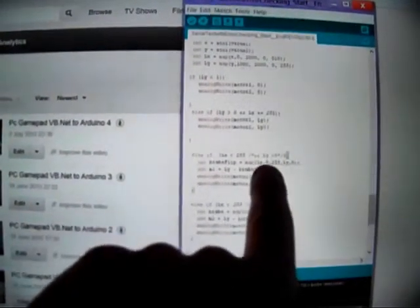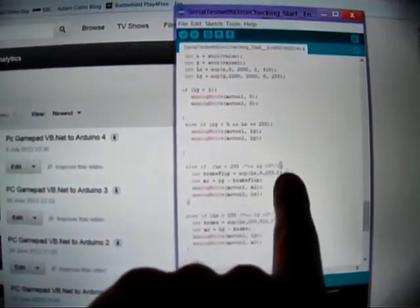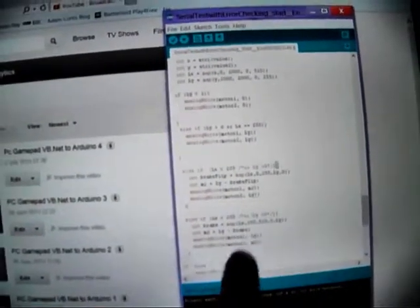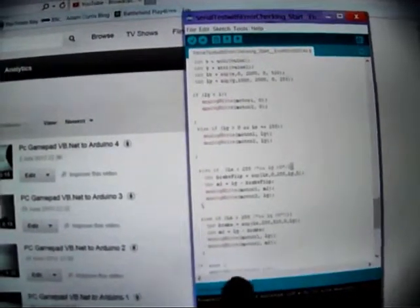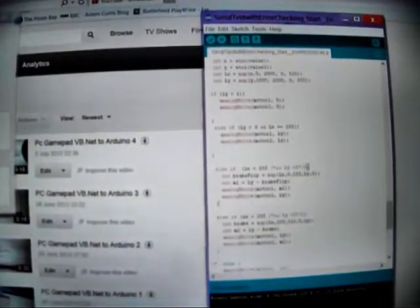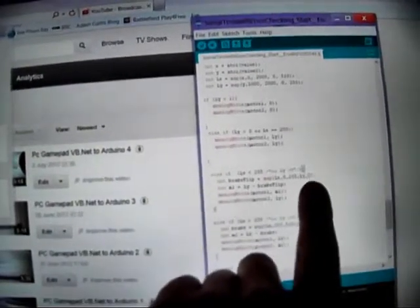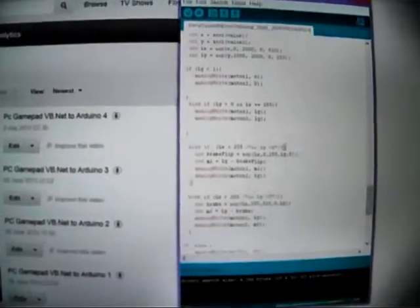What I had to do was map the brake level to Y. It's relatively convoluted and I can't really explain it like this. Basically, X input goes from 0 to 510, with 255 being zero. And then I mapped the braking on one side from 0 to 255, the forward momentum to 0, and then vice versa on the other side. It probably makes more sense if you sit down with the code and think about it.